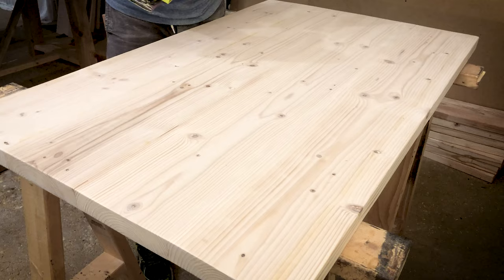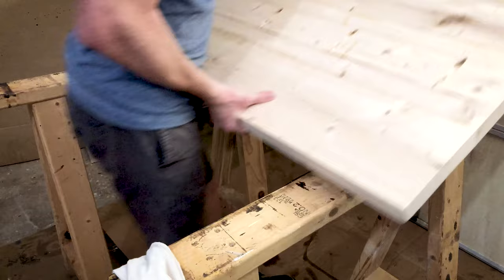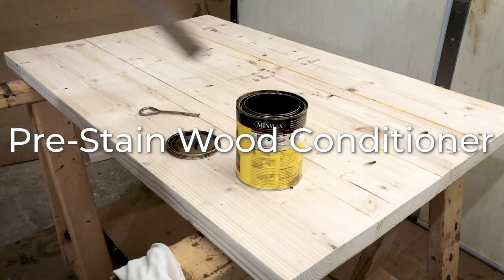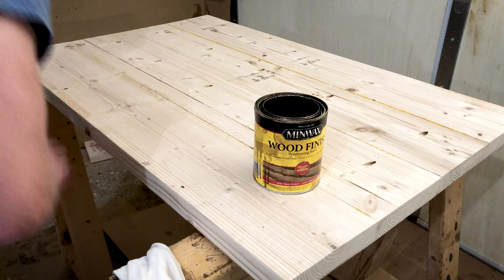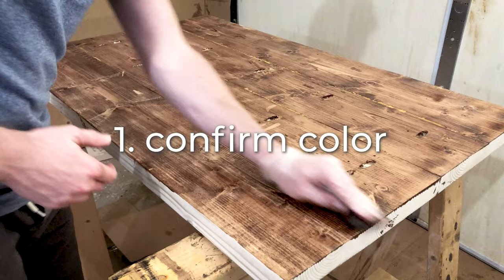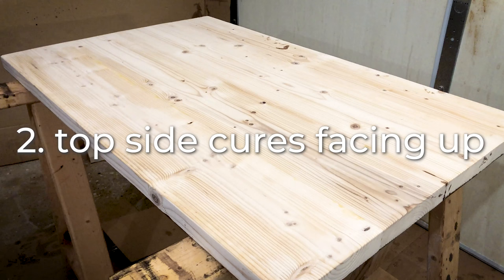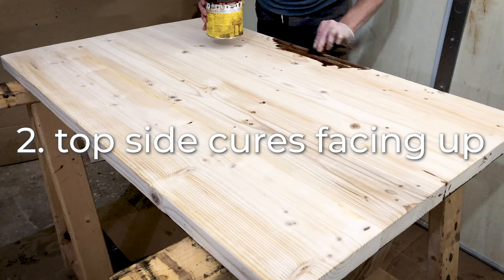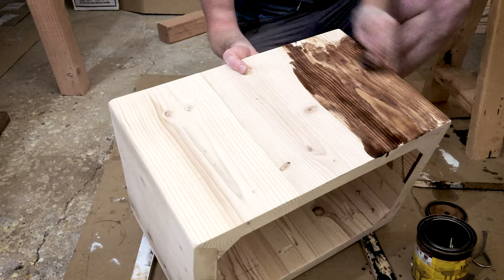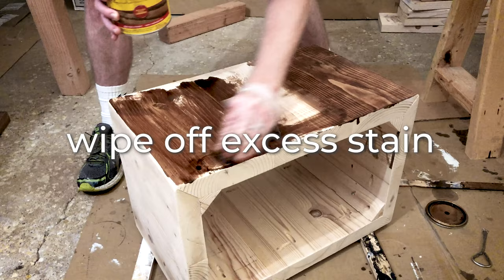The next step may be the most intimidating, but since most of the work and sanding is behind us, this part isn't too bad. Before you begin staining, it's good to place a coat of pre-conditioner and wait about 15 minutes before you start staining. That helps prevent blotchiness around knots and areas of the wood where it's more porous. It's also good to start on the bottom side of a piece when staining: you want to make sure you're happy with the color of the stain before touching a visible part of the piece, and you want the important side facing up so nothing ruins the stain finish while it's curing. When applying the stain, I like to use a piece of an old cotton t-shirt and work in long, broad strokes to ensure a consistent amount of stain is applied across the whole piece. Once covered, make sure you come back and wipe off any additional stain or it'll leave a wet, tacky, and uneven surface.